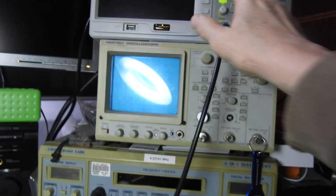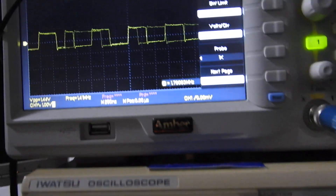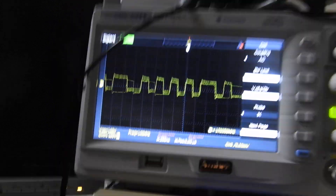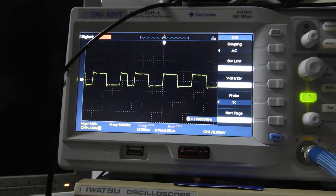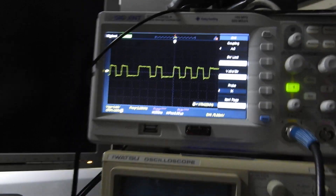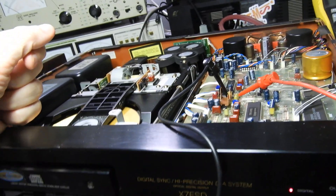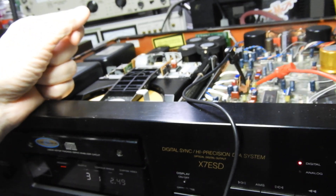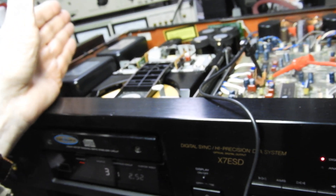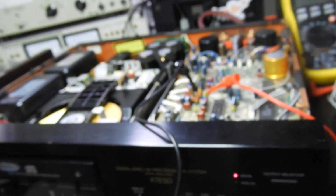The output can be either digital or analog. Looking at the oscilloscope after waking it up, the traces look pretty good — there's a tiny amount of overshoot but it's almost as square as you're going to get. There was a bit of artifact on it before, and I'm still going to take out that board and check if any capacitors have gone bad or a connection has broken.